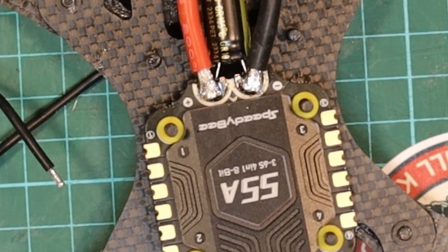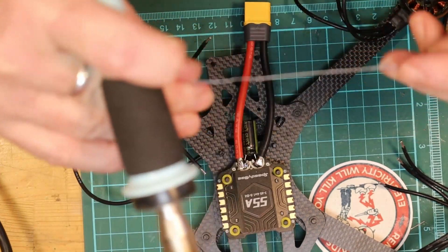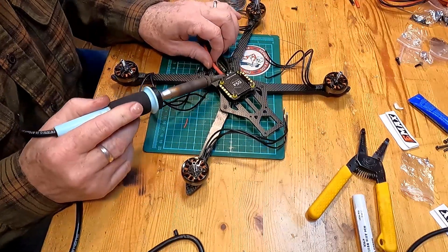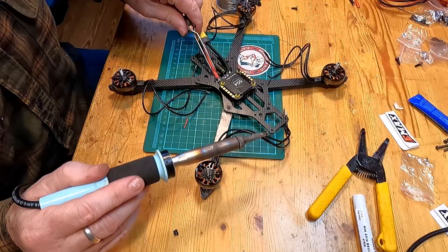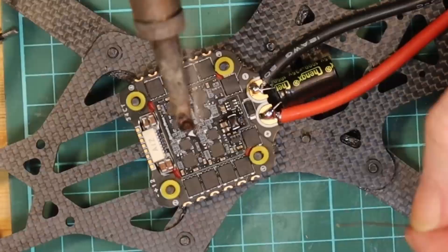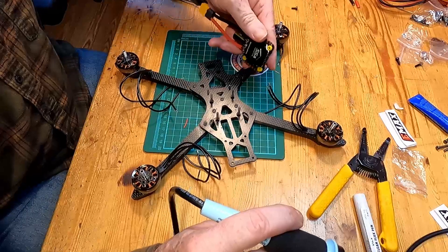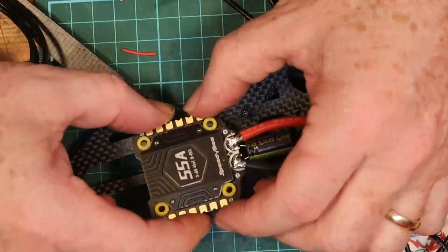That's just the initial attachment — we're going to have to add a bit more solder to that. We'll do the negative side the same fashion, line it up where we want it. As an initial setup that's good, but those are not finished — they need more solder put on top. There we go, that's much better. Everything looks good, we can pop this off and make sure nothing is bridged underneath — it hasn't. Just put a drop of solder on the back to cover up the lead a little bit, and now we have the XT60 and the capacitor soldered onto the ESC.